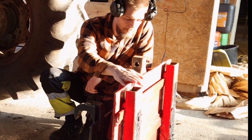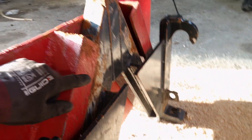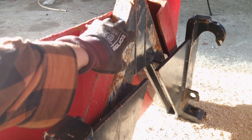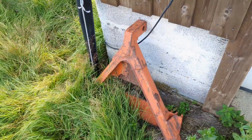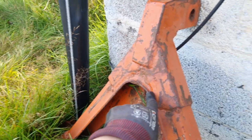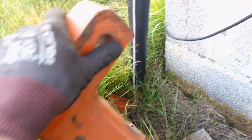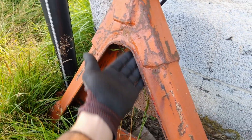And then this goes onto the pallet forks, because I used those on the other tractor. So this is a triangle — a very common adapter in Norway. This is obviously homemade, but these go onto these. So this is the equipment part; this is kind of a three-point hitch. You put that on the equipment, and then the other part, which is the tractor part, goes inside of this, and you can easily change equipment.